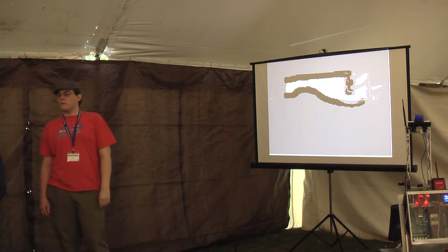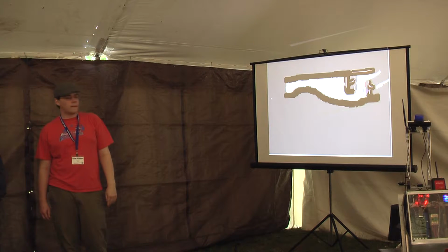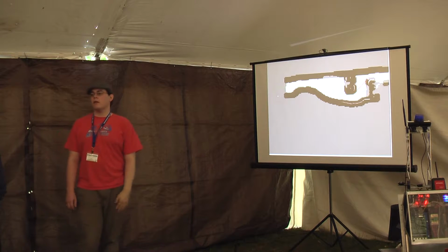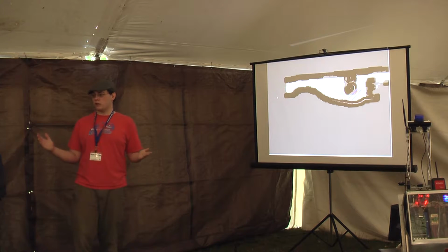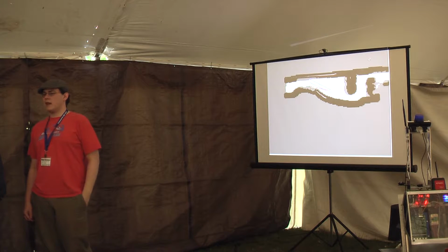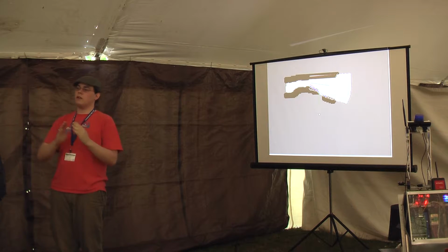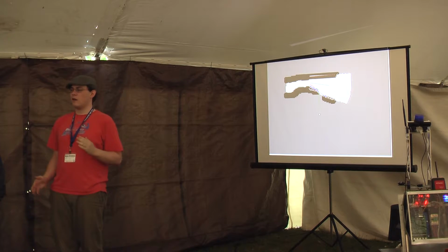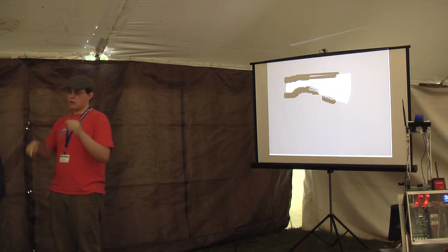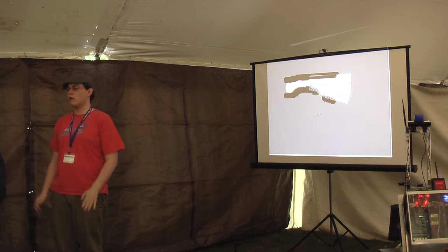And so how do you get around the obstacle there? How do we generate that green path? An algorithm called Theta star is doing that, which is a search algorithm. It's a variant of A star. Basically, it's A star except you keep doing line of sight checks when you do additional node searches, so that you can make it any angle, as opposed to A star, where you end up getting this awful grid behavior where you're only allowed to do grid neighbors. It's very blocky. So this is just a modification that allows much smoother angles.